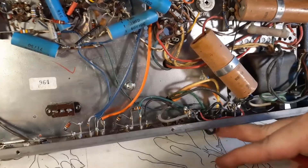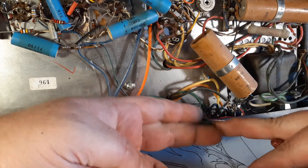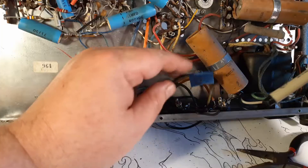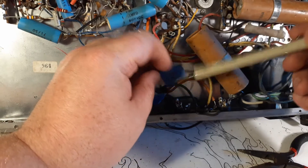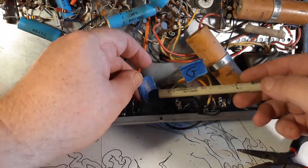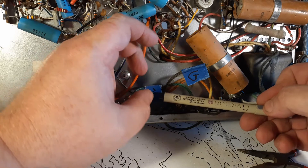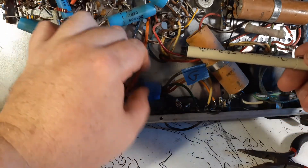This little selector here selects the impedance of the speaker output. I'm going to go through and label each of these wires. I clipped two wires here — one was the ground wire and it went straight to things that are getting cut out, so I labeled that with a G. The other was the 70-volt feed which went to pin 3 — that will not be used. I'll wind up covering it with some shrink tubing and essentially deleting it.